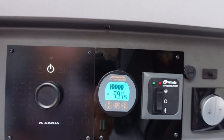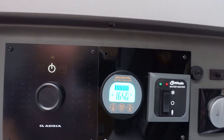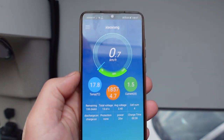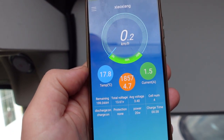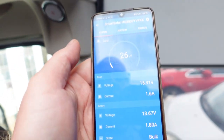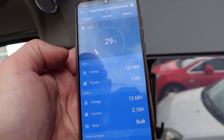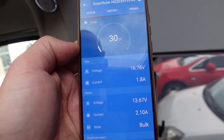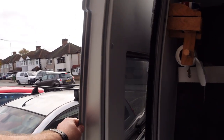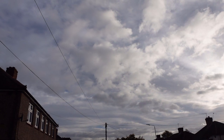At the moment I'm charging the battery — it's at 99.4% and taking in 1.7 to 1 amp from solar. It's got 198.7 amp hours. The app shows 199.04 amp hours, which is pretty accurate to my gauge, and it's taking in 1.5 amps — exactly what my gauge shows. On the Victron setup we're getting about 27 watts out of the panels at 15 to 17 volts, trying to put in 2 amps, because I've got 300 watts of solar on the roof.